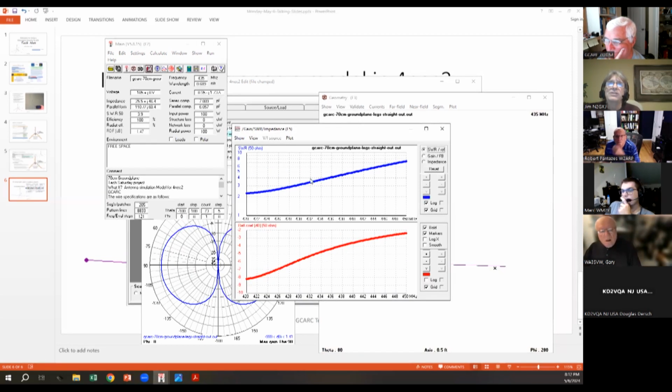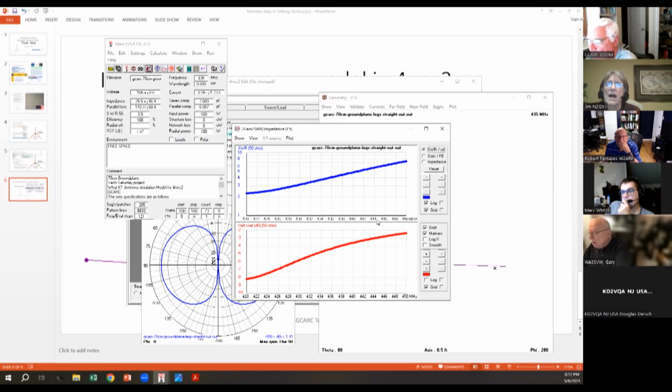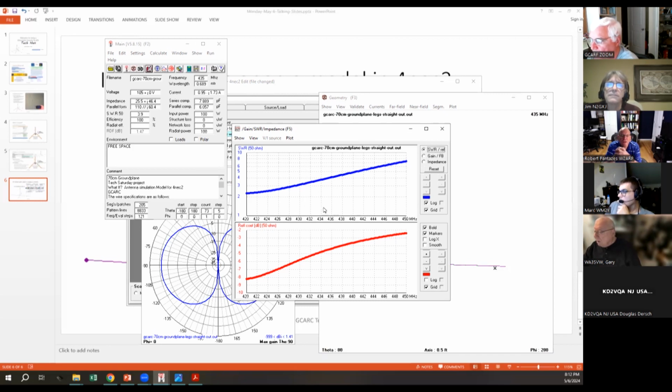Oh my goodness, this is a different looking SWR curve now, isn't it? I went from 6.5 inches up to 7 inches just for that letter A, the thing that was sticking straight up in the air. What happened? I thought the low point was around 444 megahertz. Where is it now? Lengthening the antenna did what to the resonant point of this antenna?